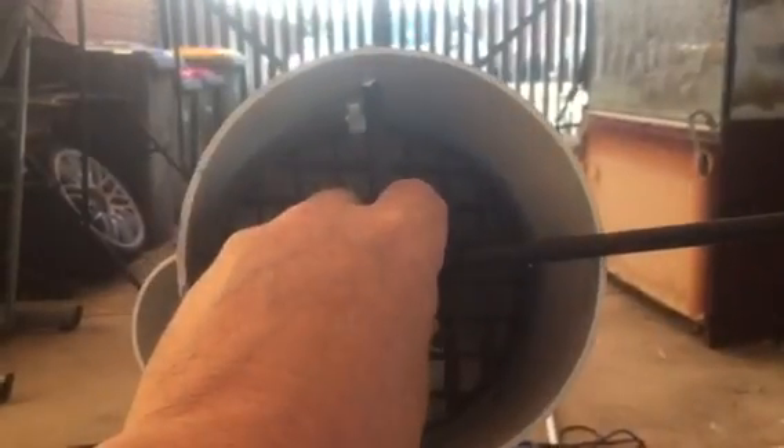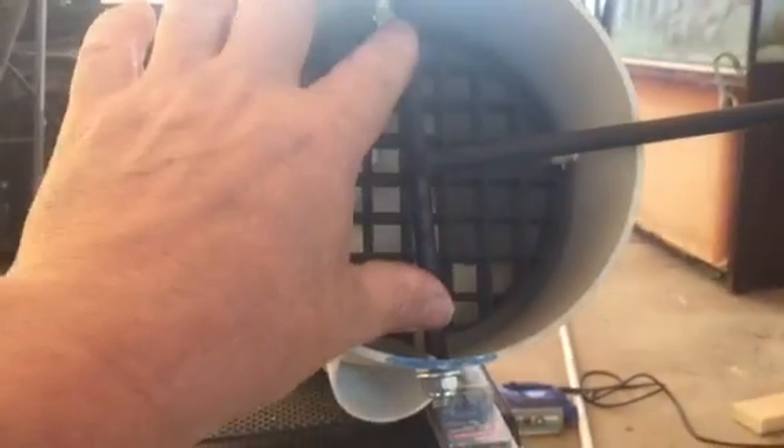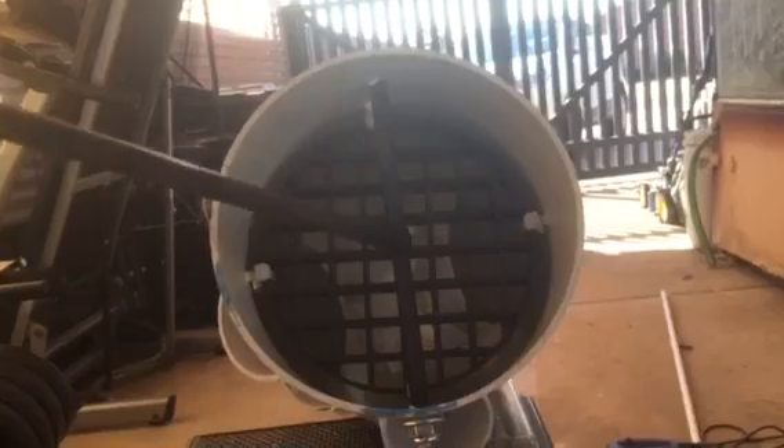On the top here, this is what I just made — it's a piece of 8mm threaded rod and I've welded it just here. On the outside to keep it waterproof I've used shrink wrap, put that straight on, used the heat gun, and that makes the whole thing waterproof with a little bit extra around the weld as well. That's what it's going to be hanging on to make it turn.